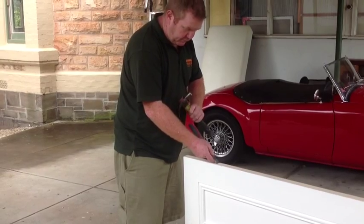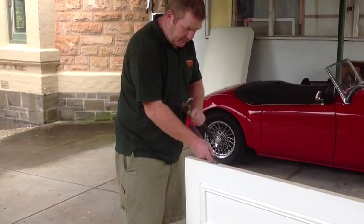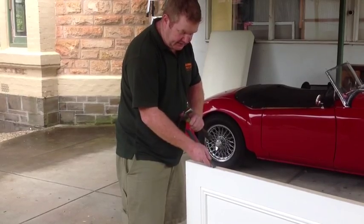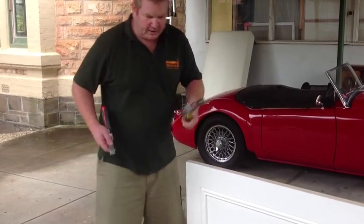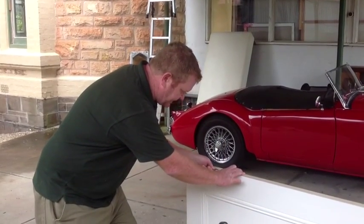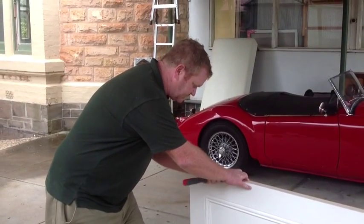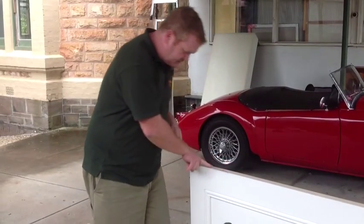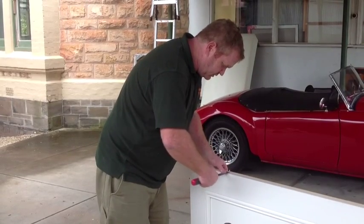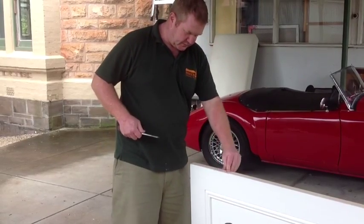Now, when you've been doing this for a while, you'll get the hang of chiseling down to the correct depth. If not, the way you can do it, and I'm doing it now, is you chisel down. I'll go all the way along, but then we chisel across. So in this case, I haven't quite gone down to the right depth, but that's fine because we're not in any rush. We just chisel across like that, and this is where these first set of marks are important. We're now chiseling towards those and following these bigger chisel marks that we're making here.